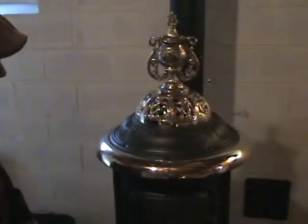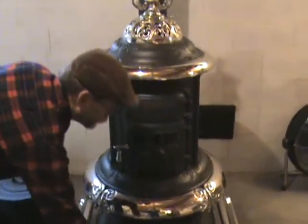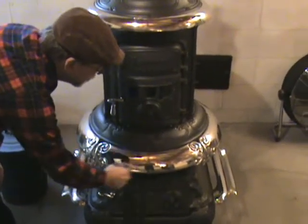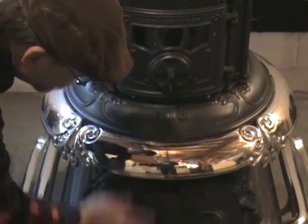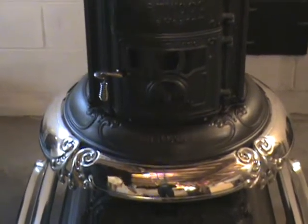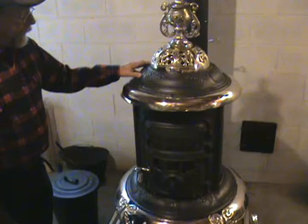There are several other features that help the efficiency of the stove as well. When something is heated, it draws cool air in and creates a convective current — the hot air rises and draws cool air toward it at the bottom. What this skirt does — and this isn't for decoration — is create a turbulence. When the air is warmed and pulled up, this creates a turbulence and breaks up the current, and it creates a flow across the floor. You can really feel it. This ring does the same thing — the heat comes up and it circulates it around, which increases the radiant efficiency of the stove by quite a margin.